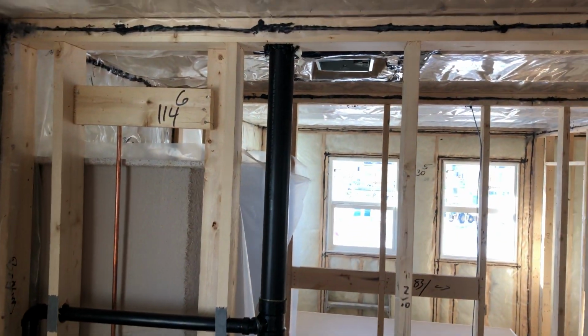You guys are all wondering, how did you measure your sidewalls? Well, the trick, guys, to doing your sidewalls: you measure your back wall, like I said, you take your half inch off. For your sidewalls, you want to get an exact measurement. You're not taking anything off. You want an exact measurement, and you take 7/8 off. And that's your measurement for that wall. That's how it works. So let's have a look real quick at what the benefits are of doing that.